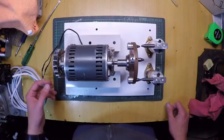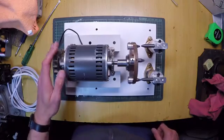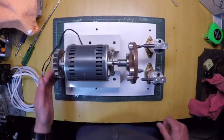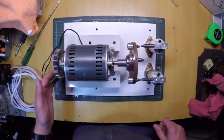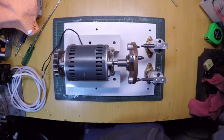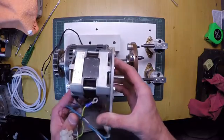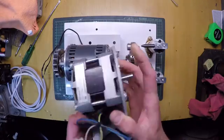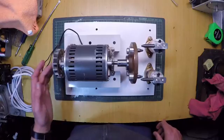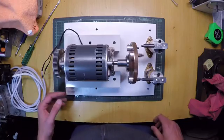Hello YouTube, this is my attempt at making a synchronous rotary spark gap for a Tesla coil. This is rotary gap version 2 — I had one attempt before this. There was a motor, this one right here, and it turns out it wasn't quite powerful enough to turn this rotor. It would sync up and lose its sync, then it would misfire and carry on.